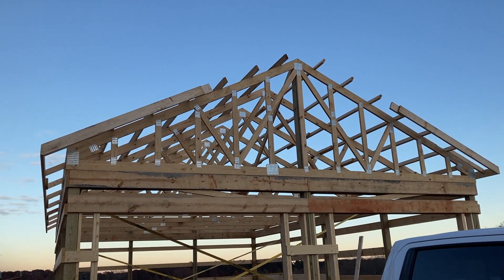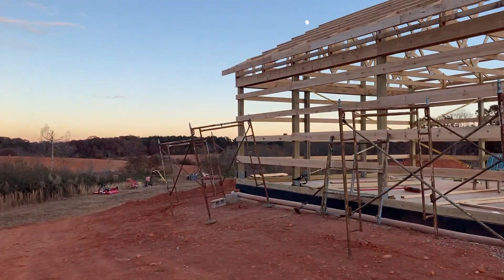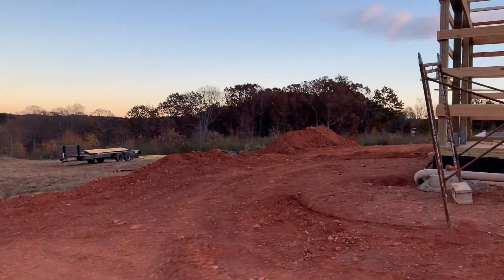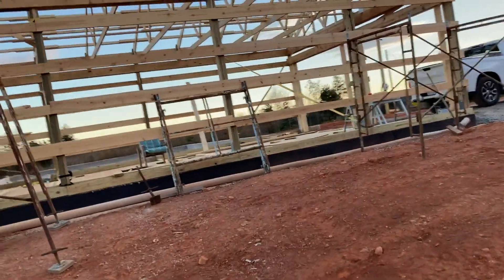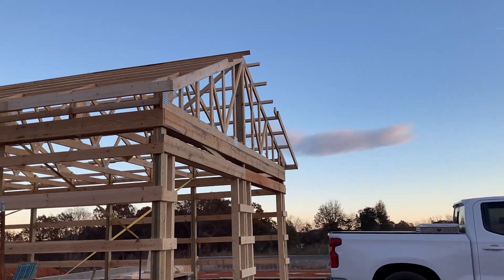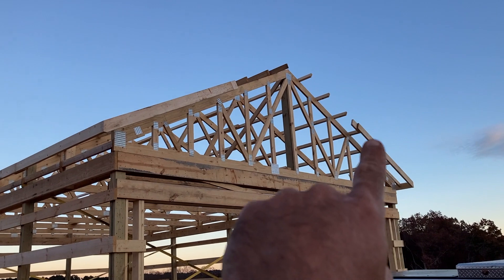The gables have eight feet run up on both sides. The terrain is a little uneven in the back, so I didn't feel comfortable with the scaffolding — plus the scaffolding is a ton of work to move two sections if you're stacking them. So tomorrow I'm just going to go rent a little man lift and get the back overhangs done with that. I need to get the end purlins run — at least get the two end ones here and the two end ones down there run. The middle ones I can pick up later, but I want to get those run up all the way with the machine.